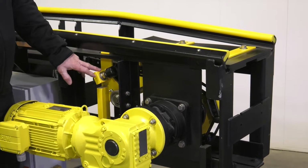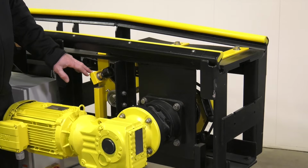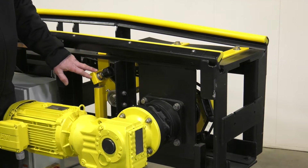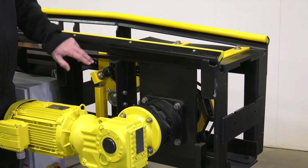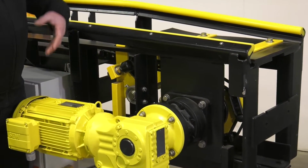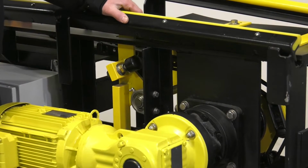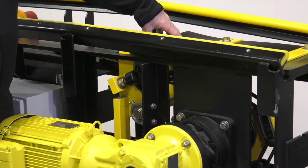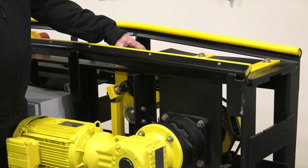Now this is the XR1000 right here. The RG-440 has a little bit different configuration here, but it's important to lubricate the bearings, to inspect the safety door, make sure there's not any cracks or broken welds, inspect the stops, make sure the stops haven't worn through, and that the system is intact. It's also really important to make sure that your exit safety plate, that's this on top of the conveyor, is in place and sound.